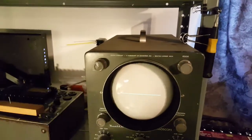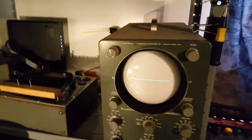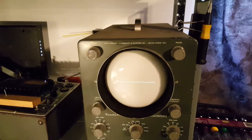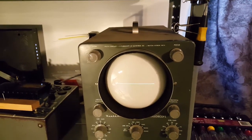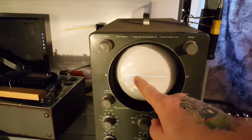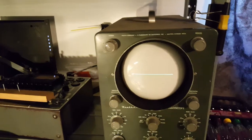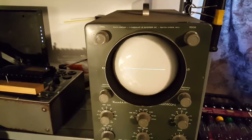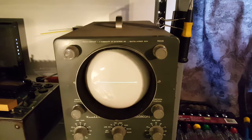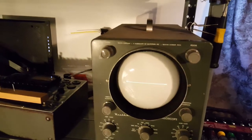It was a pretty good project. It was a little frustrating when I first turned it on. I had a bad solder on the horizontal position that wasn't working correctly because the trace was gone - I had to build a bridge for it. You'd turn it on and get a dot right here, and then it would just slowly creep off the screen and be gone forever. So I started going through stuff, reading stuff, found the trace that was gone, built the bridge, and that fixed that.